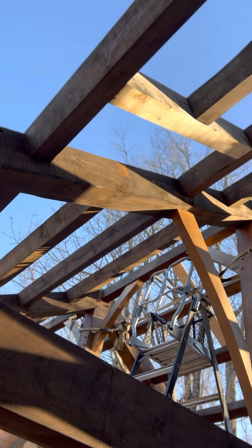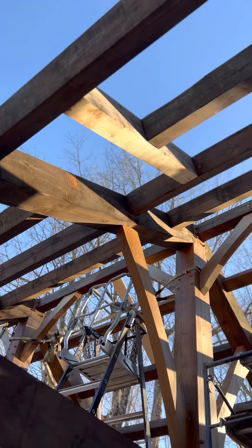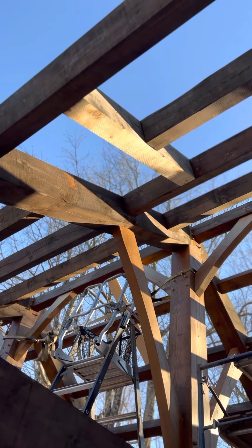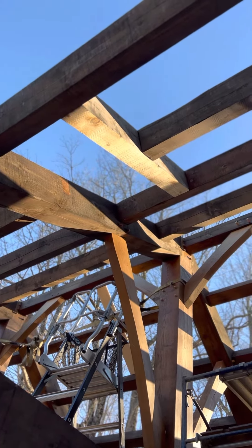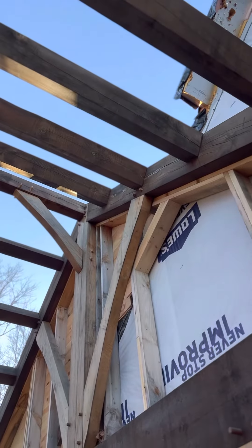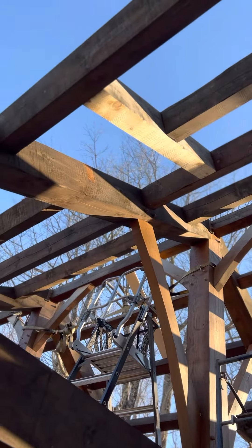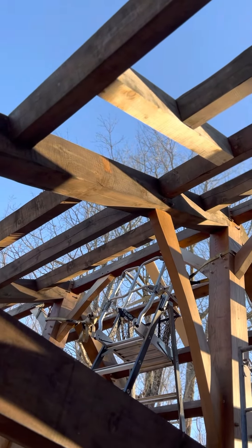That's the handiwork today — going in, removing a purlin, taking out a couple other purlins, putting in some mortises, cutting a short piece with mortise and tenon. Get the length for this piece, cut it back, re-tenon it, and put it together. So that's what we did today over here, getting ready to put the chimney in.